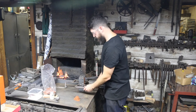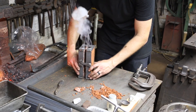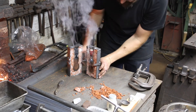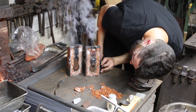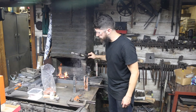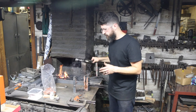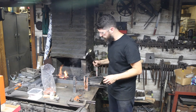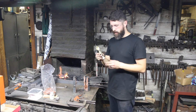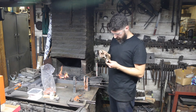Alright, I'm going to open this up and check it out — and look at that, I got a complete pour. So that's what I got there. Hopefully my sand core will bust out. It's just hard to tell when you start pouring — it just doesn't seem like it's enough, but clearly there was enough there. I think my sand core worked; I won't know until I cut this apart, but I think it worked.